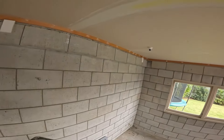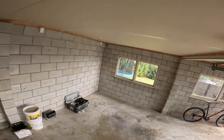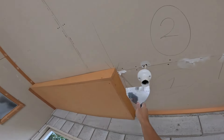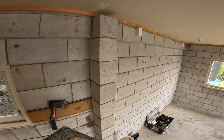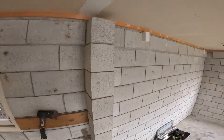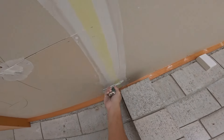We've filled that recess with compound and pressed the tape in, now we're just going over the tape again. I've mixed up a setting compound or base compound — it's a 90-minute set time. Remember, that's the time for it to harden, not for drying, so it takes a full day to dry. I like to wait for it to fully dry before doing the next coat. I'll first coat everything in one day, second coat the next day, let that dry, third coat the day after, then come back and sand. I don't like going over things when they're still damp. When plaster dries it shrinks back, so I want to allow for that shrinkage before applying the next coats.